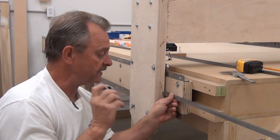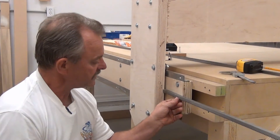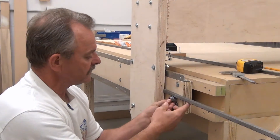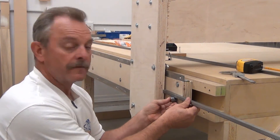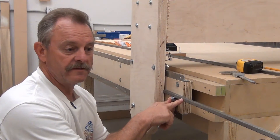In the future we may recess the motor housing just a little bit to get more shaft into the gear if it becomes a problem. This rack is going to sit upside down so I don't get any debris in it that could cause problems with the gear meshing. With that settled, we need to start milling all our parts — the gear rack needs to be drilled and countersunk.